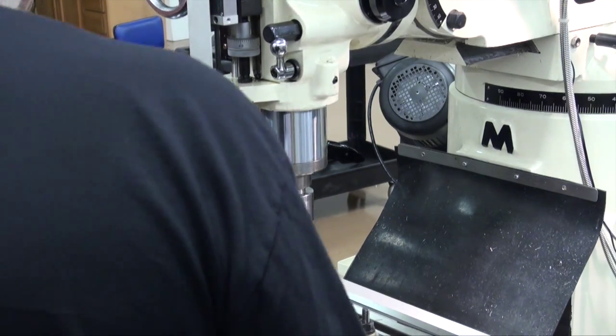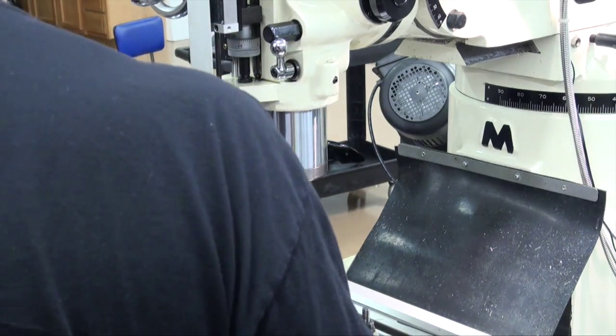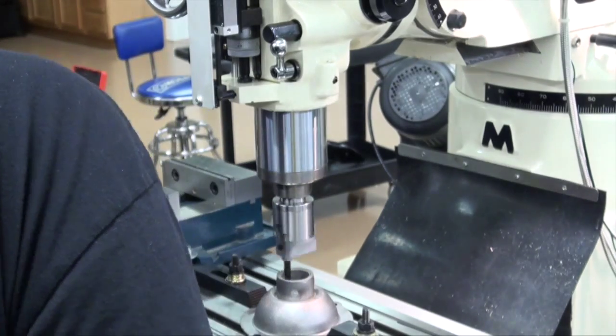But on the caps, burn out the babbitt, clean it all up. I take the flapper wheel and go in there and clean it all up. I re-tin that. Some of them I find aren't tinned. I re-tin it. Put a hose clamp around here with a little piece of brass to keep it from running out. Pour it, let it cool down, bore, get it to size, drill that out. Kind of take your knife in there and kind of radius off the sharp edges and call it quits.